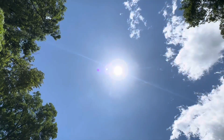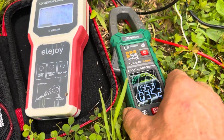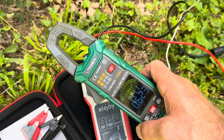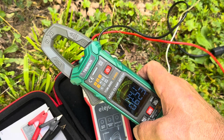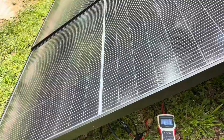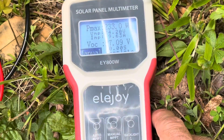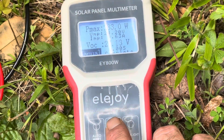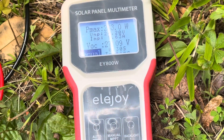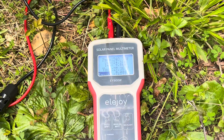Current sky conditions at time of test — you can see the diffuse water vapor. It's quite hot and humid today. Let's see what the actual ambient is now: 95.3 degrees. Panel A module temperature is roughly 144 degrees Fahrenheit, 62 Celsius. Moving over to panel B now. CalSun panel B test — I'm going to do a manual track on panel B from CalSun: 231.2. CalSun panel B test again: 240.3.